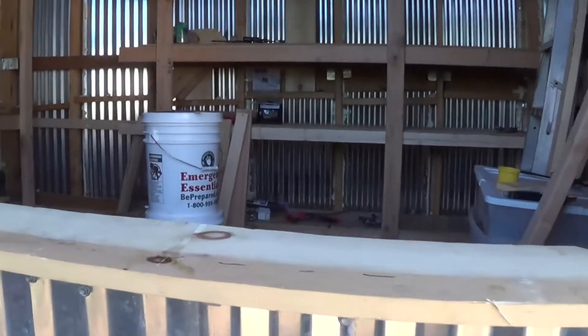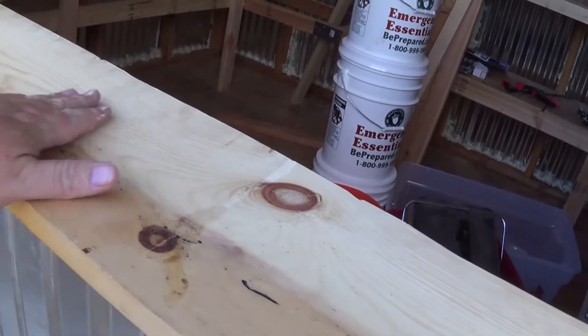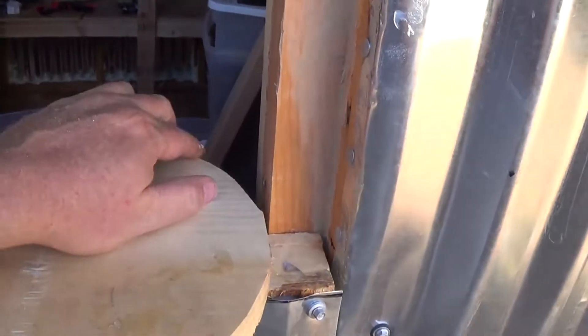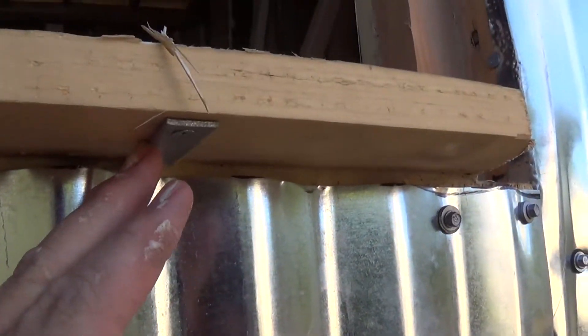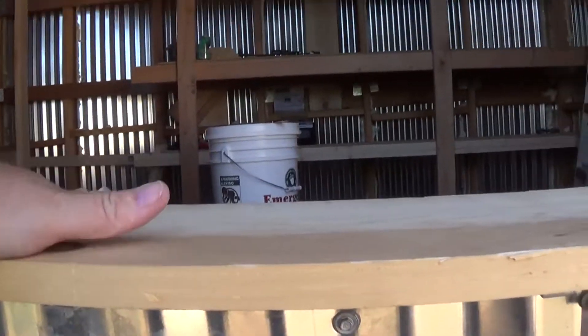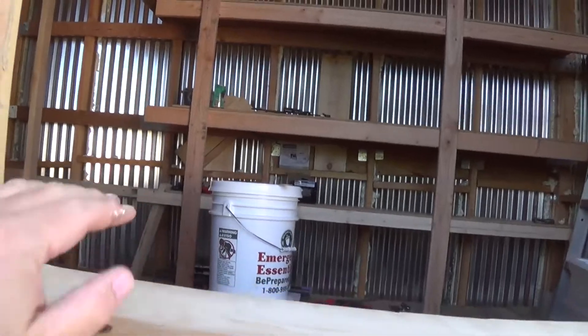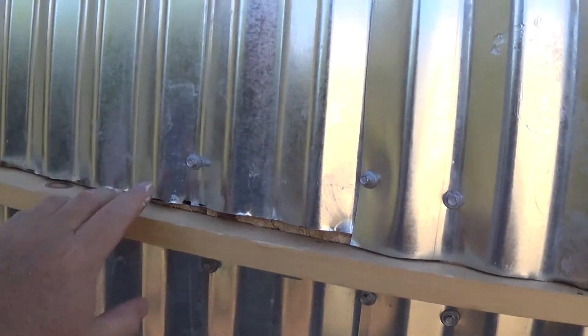You've already seen some rain and it's already stained this a little bit because I haven't put any staining on yet — I'll put some stain on here. I rounded the edges a little bit using a five-gallon bucket and a jigsaw. I did the same thing on the other side. On this piece here I put just a couple of hinges — actually four on each side — with a lot of liquid nail underneath. I tried to cut this at a slight angle so that when water comes off the door it doesn't go back there but comes out forward.